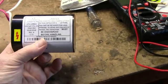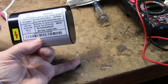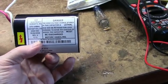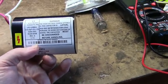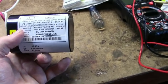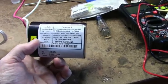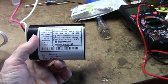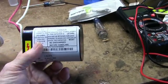Here's the large capacitor that's charged up and dumped into the leads that go to the patient. In the older units we used to use, they would develop up to 360 joules of energy — I don't know what this one's rated at, but you can calculate it from the capacitance and the voltage. If you take one of these apart, be extra careful, because at this amount of energy, if you're not in ventricular fibrillation and you get on the wrong end of this thing, you soon will be. Heed the warning.